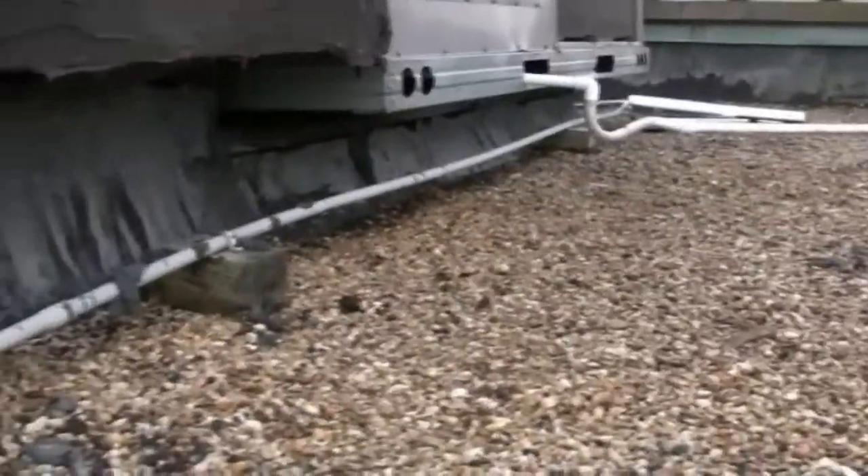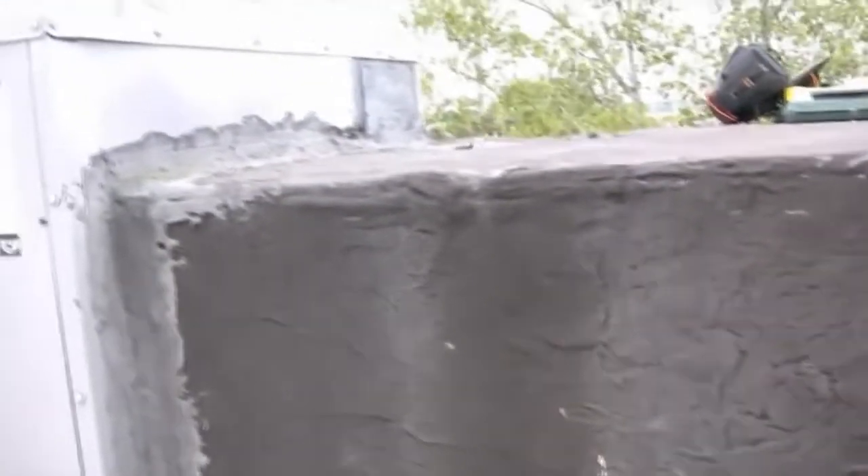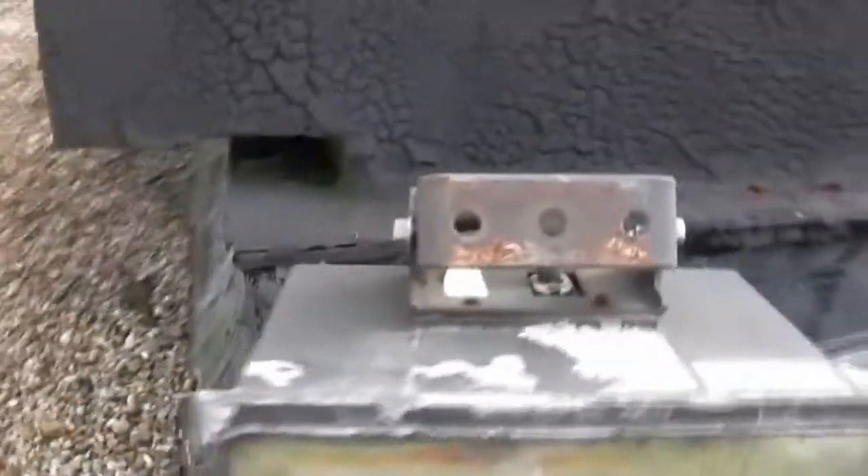As you can see, the ductwork was coated with asphalt roof coating cement — a very cheap product available at your local hardware store. Unfortunately, when you put it on a piece of ductwork that supplies cold air to the building, the surface temperature of that black asphalt in the summertime is approximately 150 to 160 degrees Fahrenheit in full sun. Even on an 80-degree day, surface temperatures in full sun will still be around 140 degrees Fahrenheit. So the black coating is not cost effective in terms of insulation or radiant heat transfer, especially at the point where cold air enters the building. The asphalt is also a maintenance issue — very difficult to maintain once applied.